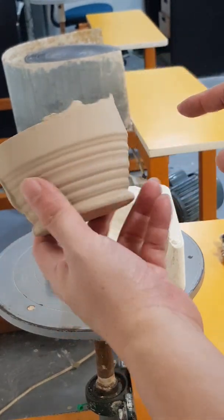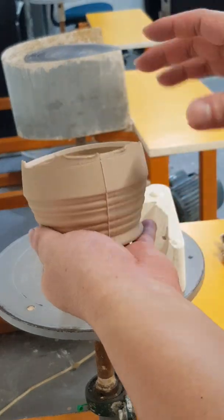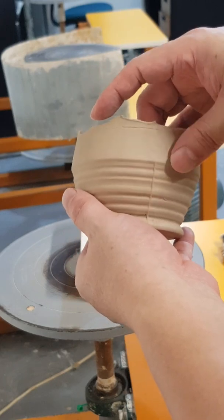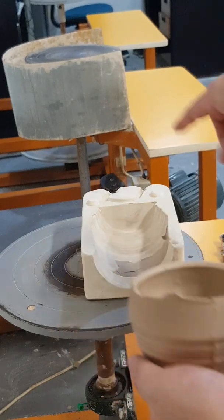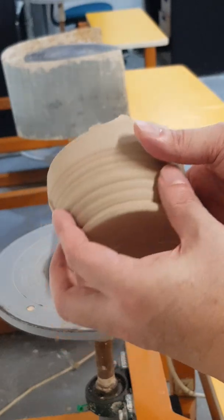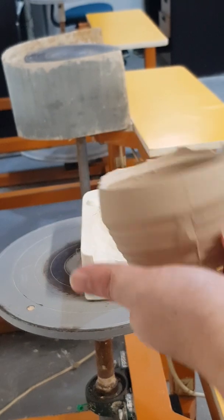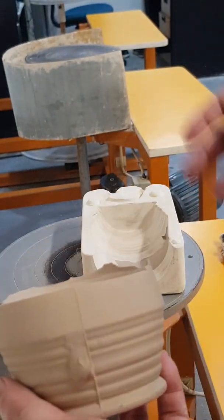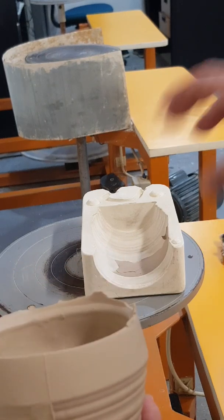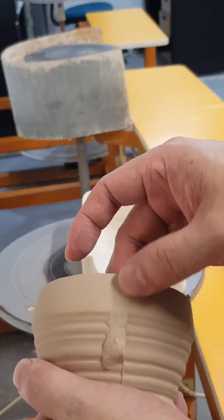So things like this are kind of common. That's why you make a mother mold of the mold itself. You have to make it into silicone, so that the silicone is like a mother mold for the plaster, so you can keep making the same plaster that is perfect. All right, that's how you keep the quality of your casting the same and good all the time. So you have to maintain that the mold is always in good condition. When it's already losing its detail or its shape, you have to cast a new plaster mold from the silicone mother, from the master.